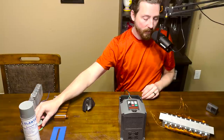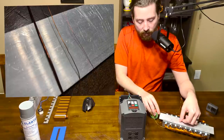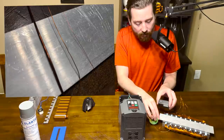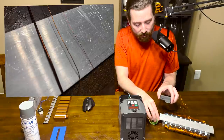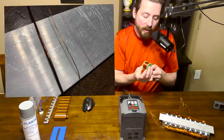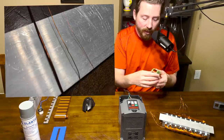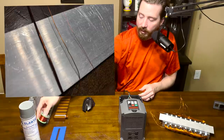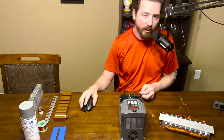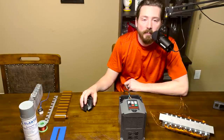In this series I want to rewind the motor for you using 34 gauge wire, which is very, very thin - almost the thickness of a human hair. Obviously since this is much thinner wire I won't be able to carry the full current on a single wire, so I may have to double up the loops, but I should be able to get a lot more turns with that gauge wire.